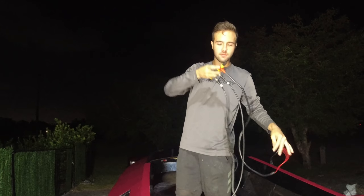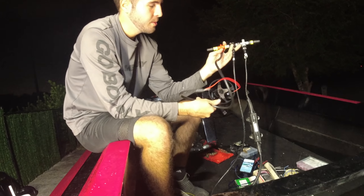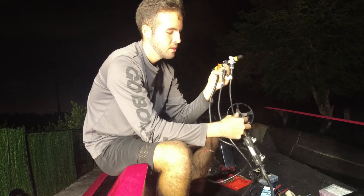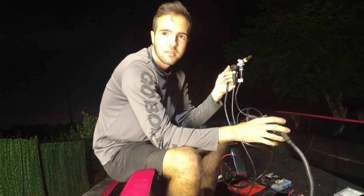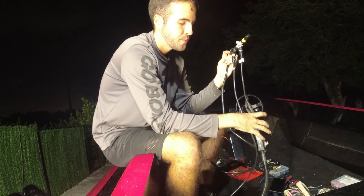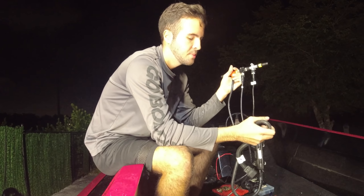So explain to me quickly — what do I need to run the gauges on a Garmin GPS? You run your NMEA 2000 backbone, with your NMEA 2000 power cable, and the NMEA 2000 cable that sends all your info to your GPS or vessel view. Then you need either a gateway or a vessel link from Mercury so it reads all the information. You just connect it to power and it goes — when you connect the GPS it automatically syncs. You have to calibrate the fuel and might have to calibrate the gauge limits for your RPM, but that's about it.